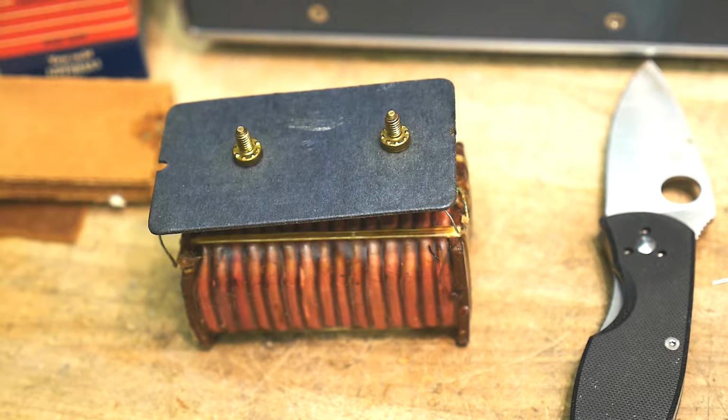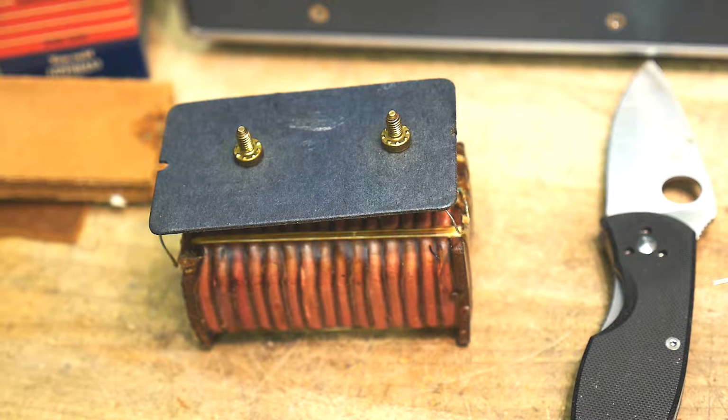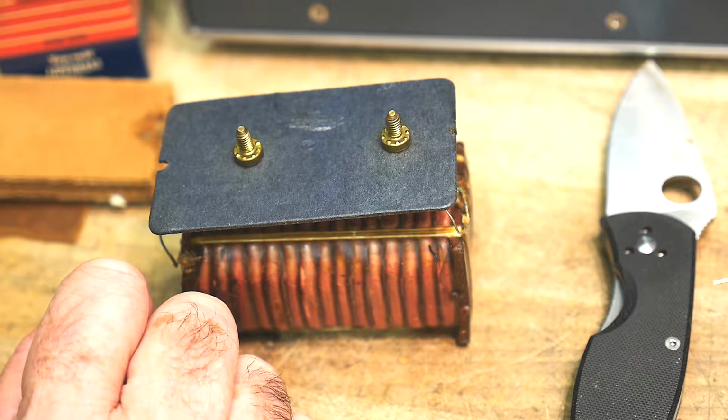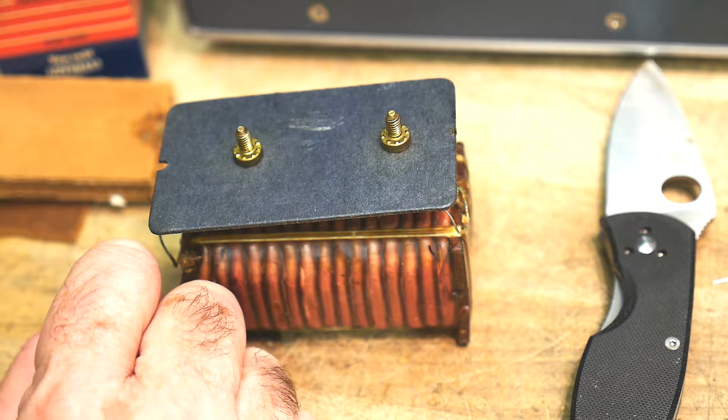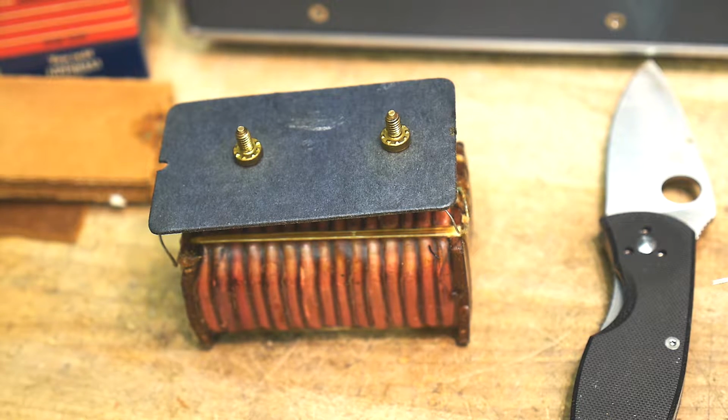So that's how it does its battery thing. And then it generates plus and minus 6.7 volts. Kind of a weird number, but plus and minus 6.7 volts. I've seen 6.7 volts in other HP equipment, so it must have been a favorite voltage of theirs. There is some circuitry to regulate those voltages and stuff. I don't know how large the dropout voltage is on those regulators, but it may be that 2 9-volt batteries would work just fine in this thing.